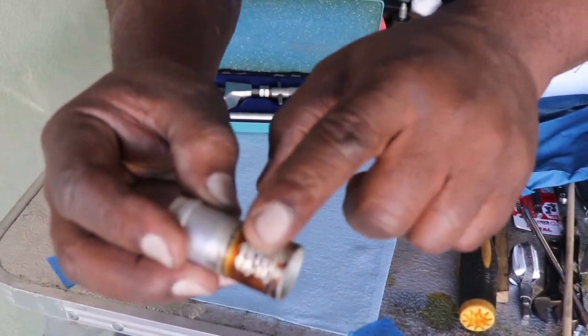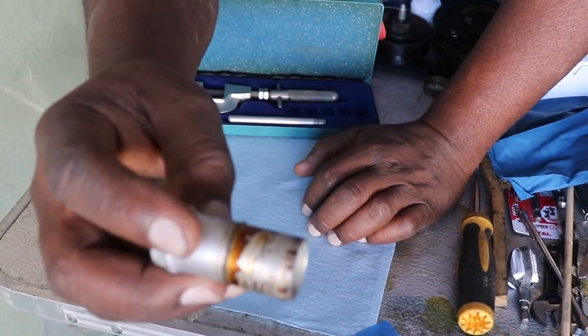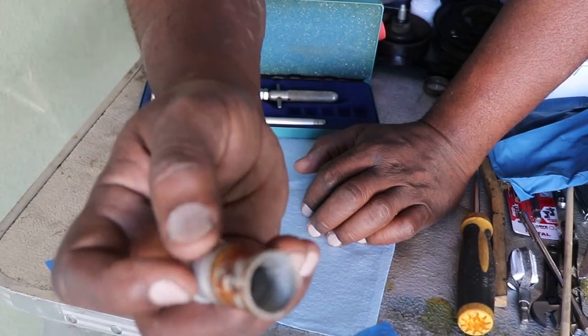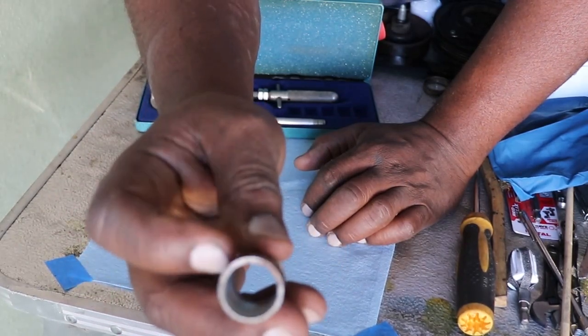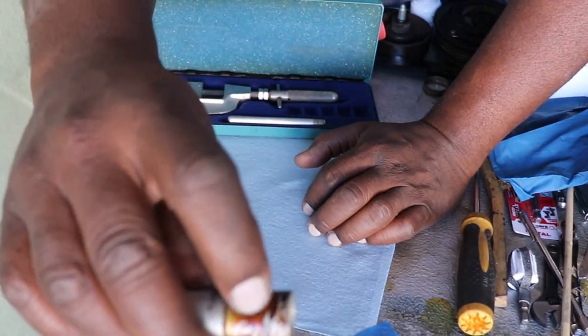It just didn't bond evenly. It squeezed out, so there was nothing there. There was nothing to control the bond line thickness. That's part of the job of the knurling. So what we're going to do now is clean this off with some sandpaper, and then we're going to knurl it right about here, right about here because we know where the adhesive is.